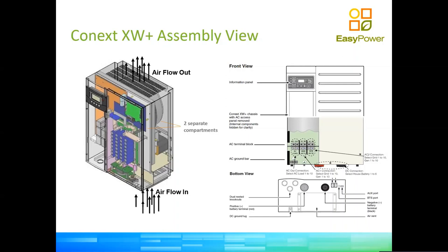So you will say, but Luis, then how does the inverter operate when it's in off-grid configuration? Well, it's very simple. It does that process automatically inside of the inverter when it's in off-grid configuration. So in other words, when it detects a grid failure, it will then connect the center tap of the transformer to earth. But you do not need to do that. The inverter will do that for you.